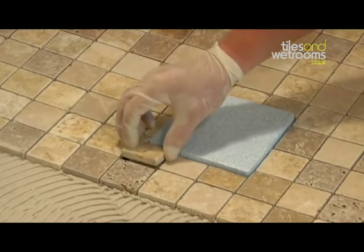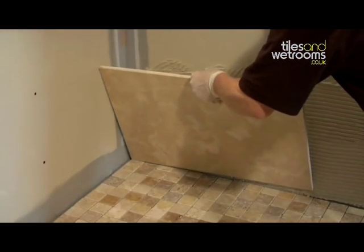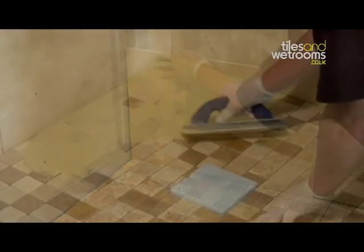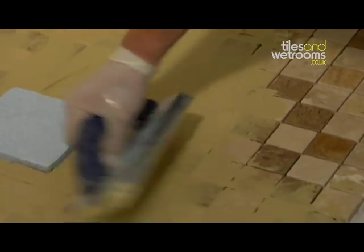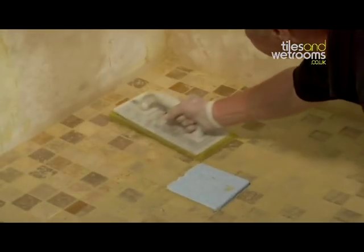However, if you use a tile bigger than 100mm in any direction, then the tiler must follow the falls in the shower tray with a cut line in order to maintain the pre-manufactured falls in the shower base. Here we are showing the tiling in a small mosaic, which as you can see, does not require cuts to accommodate these falls.